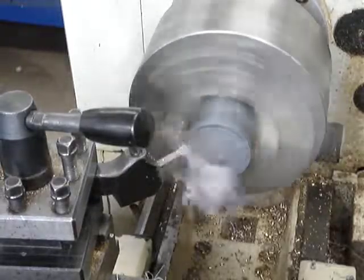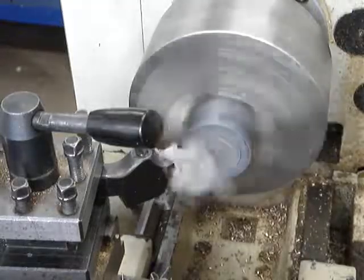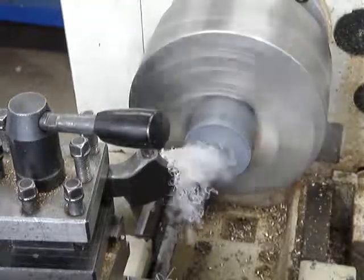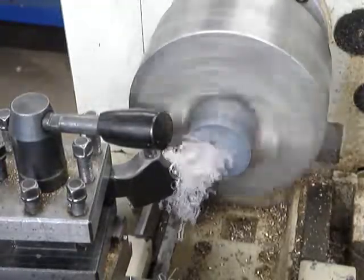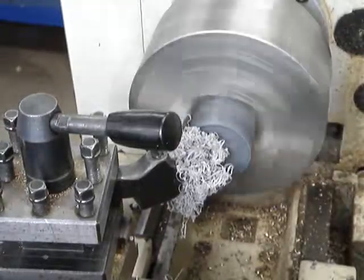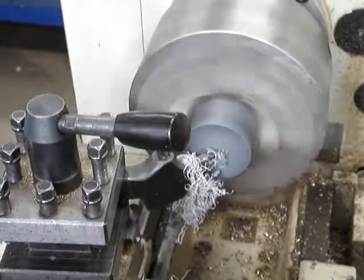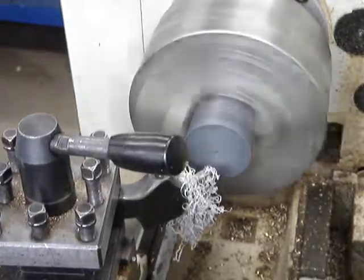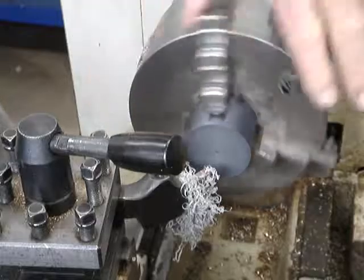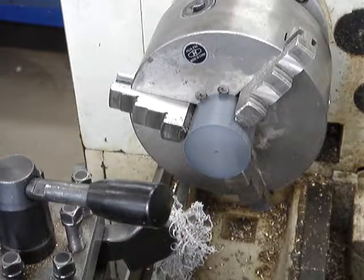I'll do this in two cuts. Material is coming off, so this will probably be the finishing cut — go nice and slowly, keep the tool moving. Don't let the tool rub; in other words, don't stop feeding the tool across, because if you do it will rub, and if it rubs it creates heat, and the heat causes the plastic to melt. It's tempting to pull away the swarf that's getting built up there, but don't worry about it — just let it stay and it'll flick off. And so we end up with a finished face. There's just a tiny bit of saw cut there, but that is done and dusted. Take that out, turn it around, do the same on the other side.